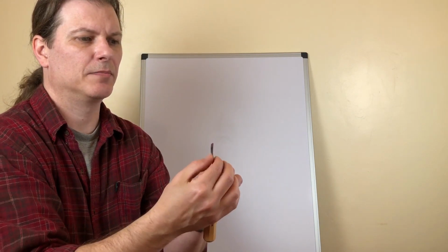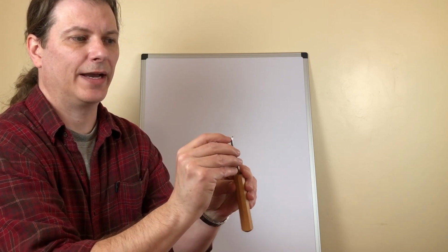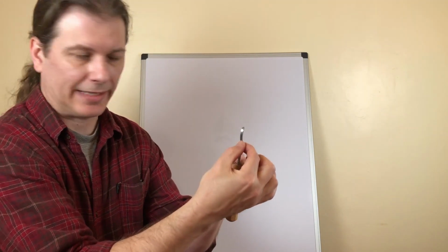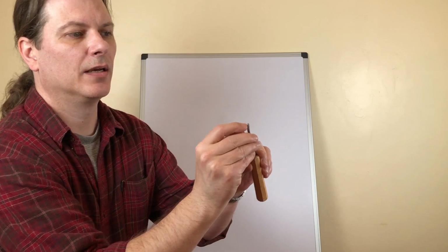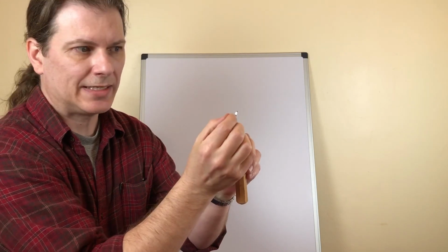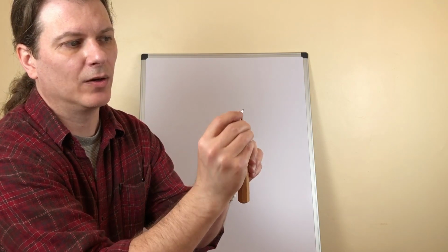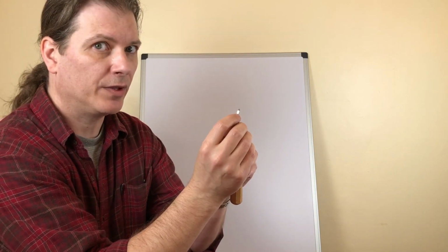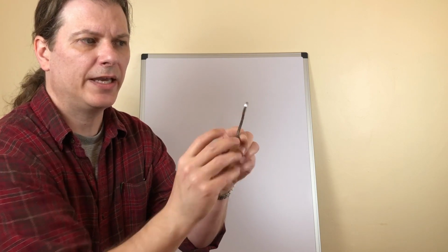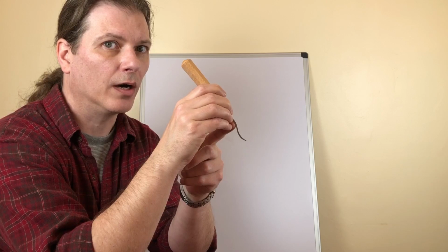What I've done is make a 45-degree cutting edge and then graduated that back bevel out wider toward the standing end of the tool stock. So where the bevels come away from the actual cutting edge to that standing stock is increasingly a higher number. So if this cutting edge is 45, then back here where the bevel meets the tool stock is around 53 or 54. And what this allows me to do is face increasing resistance as this digs into the cut, because I don't want it to go too far.